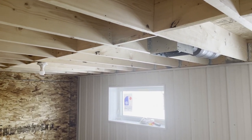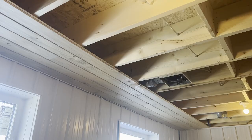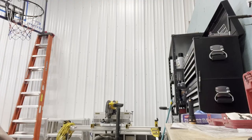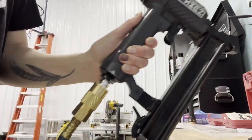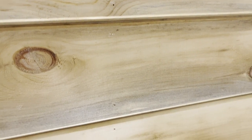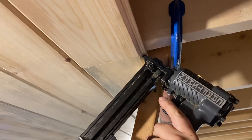When cutting boards to length, we made sure that all our seams were going to line up and meet at one of these joists. That way, each board is nailed in from the front to the back. You can nail directly through the face of the pine into the joist, which is what we did in our bathroom — still looks really good — but because we were working in a brighter space, we wanted a cleaner finish on this back room, so we nailed directly into the tongue and groove.